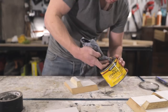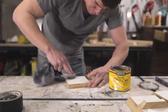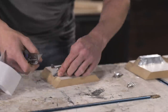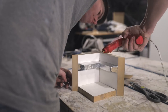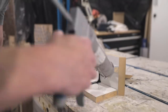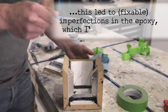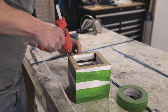To seal the form I decided to use the same techniques I used with concrete, starting with applying paste wax to the entire form. I covered all the surfaces of the melamine that were exposed particle board with aluminum foil tape, which really nicely grips and conforms to the surface and the epoxy doesn't stick to it. Since it would be difficult to get a caulk gun inside the small box form I decided to use silicone caulk on as many of the edges as I could before I fully assembled the form. I used a metal fondant ball tool to clean up the lines.